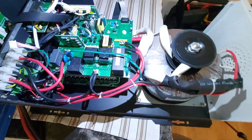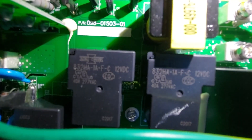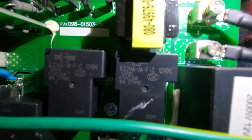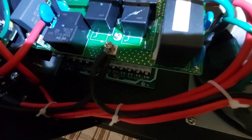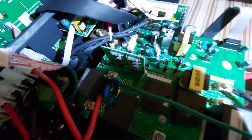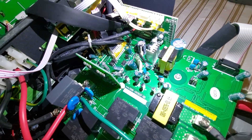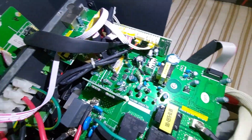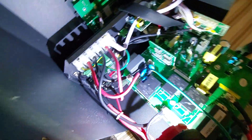Let's see what these... these are 40-amp relays — wow! In the AIMS they're 30-amp at 277V, so these are actually 10 amps rated higher. That's pretty awesome. Why do we have a resistor board here? What are they doing there? It's just flapping around in the breeze, as Dave from EEVblog would say. So we have 10-gauge at the power cord.